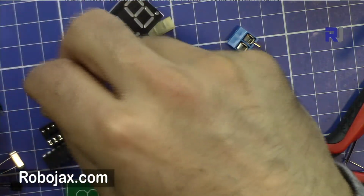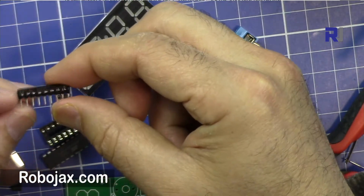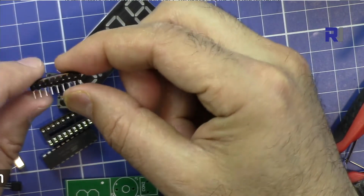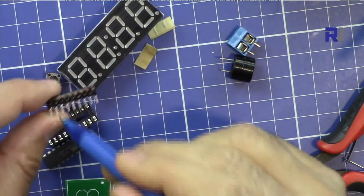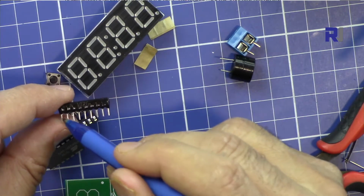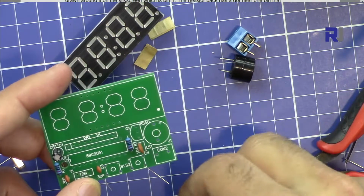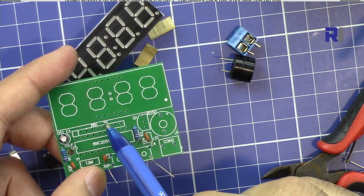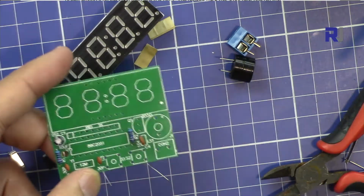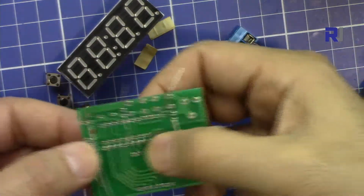And then we have the resistor network. It has a dot at the end, which is the common pin, very important. How it works is all of the other pins are connected on the top to the left pin. That's PR1, 1 kilo ohm, and you see in the corners they put a line to show. Because this cannot be bent, I'll leave it to the end.